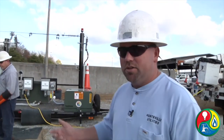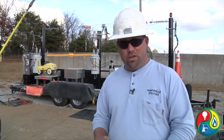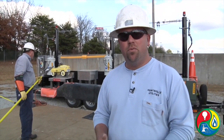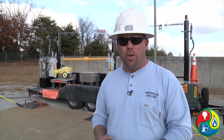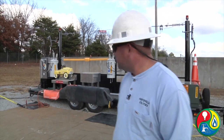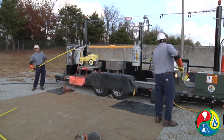Now, the next thing we're going to show you is — if you'll notice our yellow taxi — a lot of times during vehicle wrecks when a car hits a pole, the normal procedure is either the fuse blows or the breaker operates until it locks out. As a lineman, you're trained and you know when those lines are de-energized, but you have to remember there could be a person down the street that has this generator hooked up incorrectly. While those first responders are trying to rescue somebody out of the car, or you're trying to get those power lines off the car and it's not properly grounded, this is what might potentially happen to you. It could be 10 minutes into the rescue and somebody hooks this generator up incorrectly. If those lines are not properly grounded and off that car, this is what's going to happen.